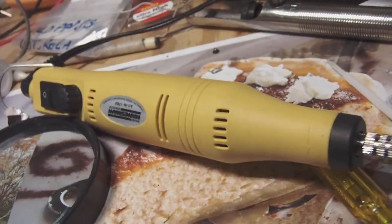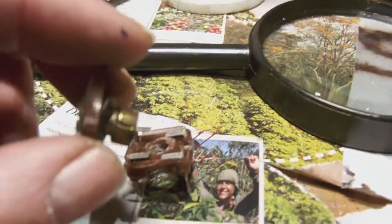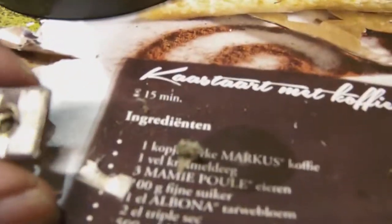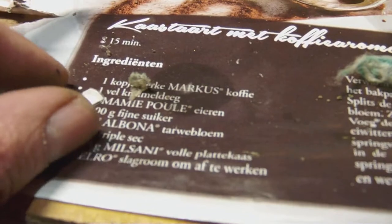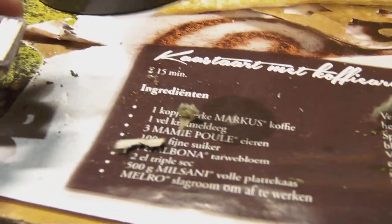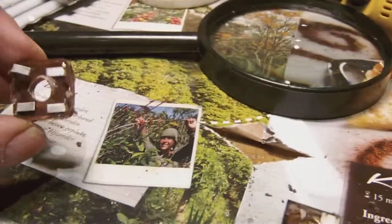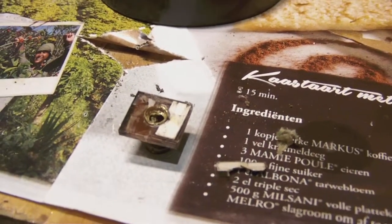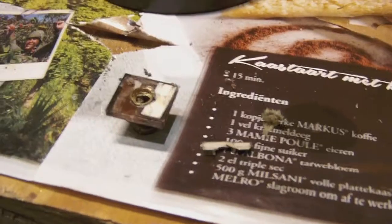Now, as you can see, between the base and the base top, or the cap effectively, there are capacitors. It turns out to be a mica shaped capacitor, like you see here, a thin layer of mica with, I think, a silver foil in between. And the base feet, as you can see, have a flat end, and that flat end makes contact, or made contact, with those capacitors. So effectively there are capacitors involved, only I don't know why they made it extremely hard to get at.